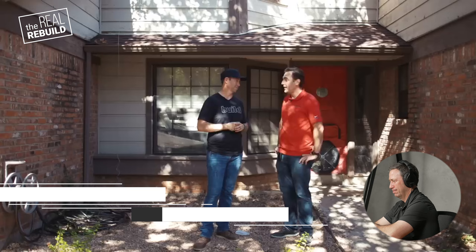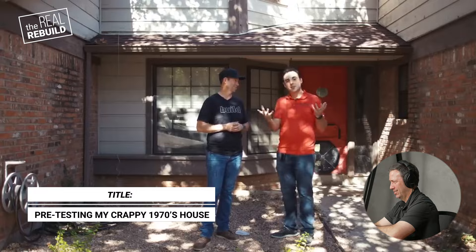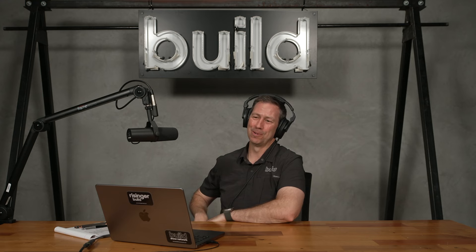Let's see what Sean had to say about my blower door score. Five ACH50 is code — 27 ACH50 is this house, which is crazy leaky. So really bad — five times over code. I'm still laughing at that. Sean put the blower door in the front door and we came up with a number. For my builder friends out there, 27.5 ACH50 is just ridiculous. Sean told me that's the equivalent leakage of a seven-foot by seven-foot hole in the wall — as if you had a sliding glass door you really couldn't close. The fan was on blazing high and had a hard time even giving us a number because there was that much leakage.